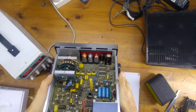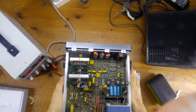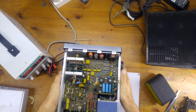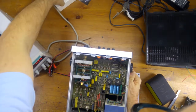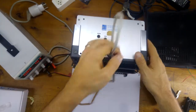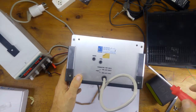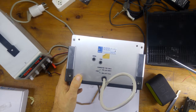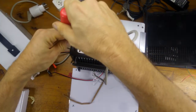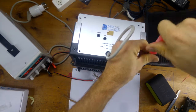This is still live so I should probably take a bit of care. The tube's doing something — nice. I want to take a look at that gammy range switch on the other side, so maybe I'll even go as far as to take the power off. One of the beauties of working with old instruments like this is you can almost always find a schematic, so they're almost always repairable. It's a Philips PM2422 A5, made in Holland in the 1970s. Let's see if we can figure out what's going on with the range switch.